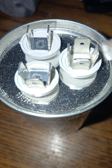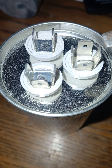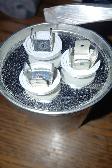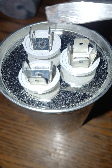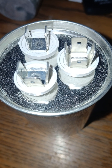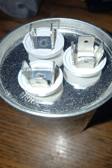First, one must identify and understand what these terminals are. The terminal labeled 'C' is the common — this comes from one side of your contactor, or the voltage side. The terminal with two connections is your fan, which operates the condenser fan motor generally located outside. The third terminal is labeled 'HERM,' which stands for hermetically sealed — this terminal is for the compressor.